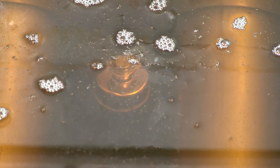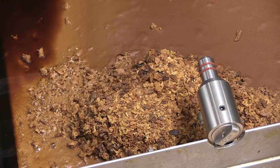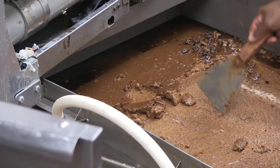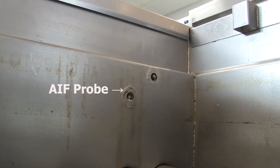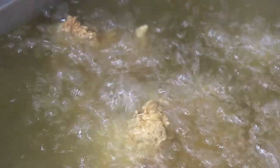This is easily remedied by stirring the oil in the vat or lifting the stuck float. Heavy breading and neglect from restaurant staff can contribute to problems with the fryer, but the fryer attempts to overcome some neglect. Oil returning slowly to the vat after a filter will produce a screen warning to clean the filter leaf. Oil below the AIF probe will produce a screen warning about low oil and will lock out filtering and cooking for 10 minutes. Cooking can resume after 10 minutes, but filtering will remain locked out.